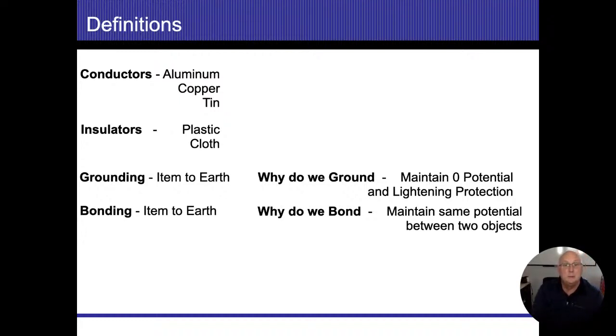The reason is there was something called aluminum creep. When it got warm, the aluminum wire would expand, and then when it cooled off, it would shrink. So the more it got used, the bigger it got, and the smaller it got. That actually loosened up a lot of wires, or a lot of the screws that held the wires together.